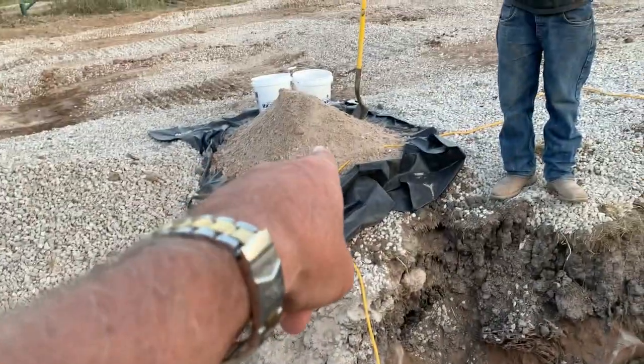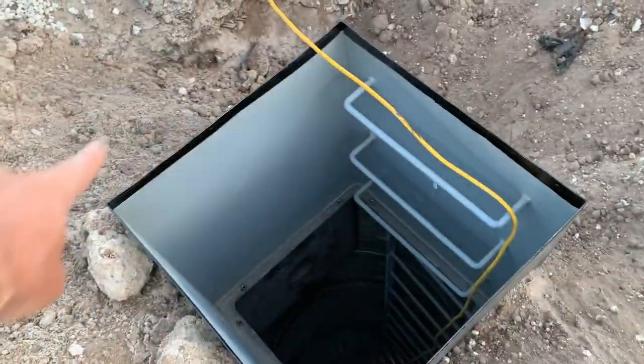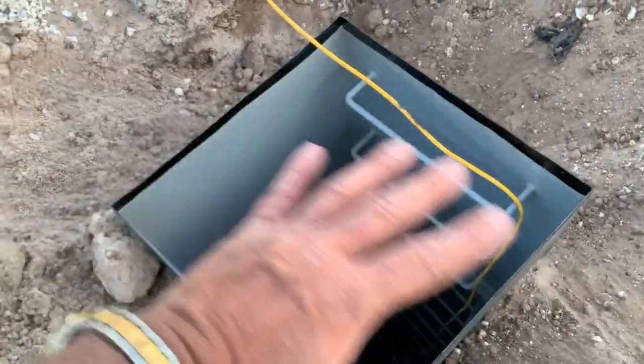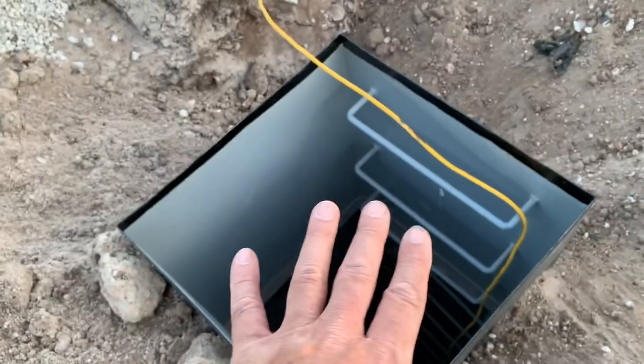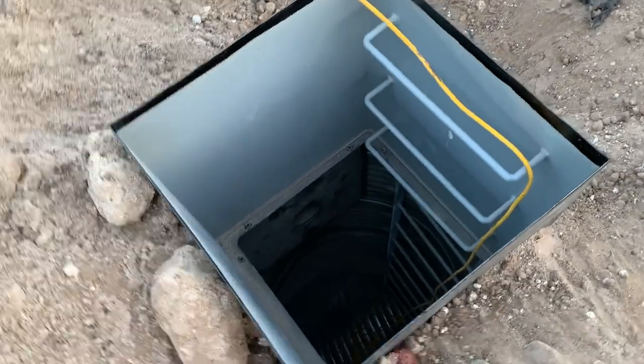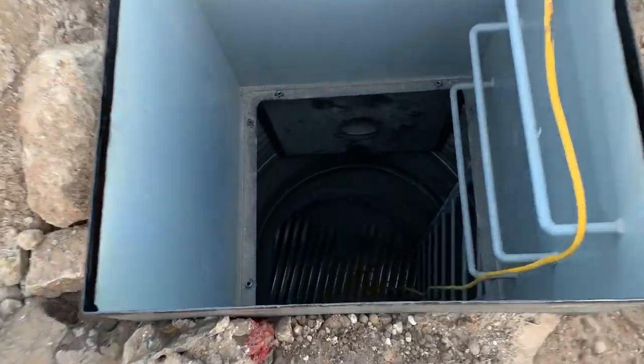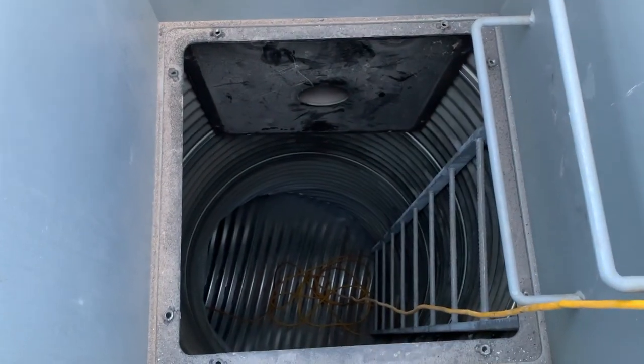They're gonna fill it with that playground sand. Then they're gonna put plastic on top of it and they're gonna duct tape it all the way around and have it humped over, okay? And then there'll be a foot of sand on top of this. That is your finished grade of earth, okay? But that is the escape tunnel from the Atlas Survival Shelters.